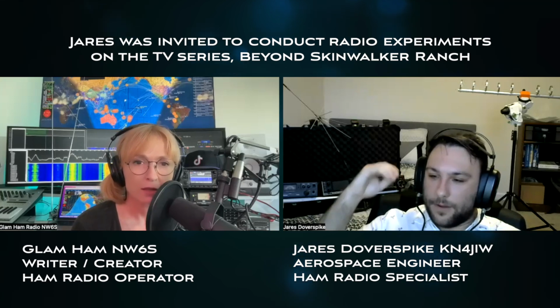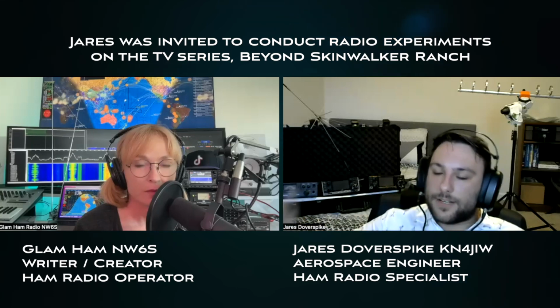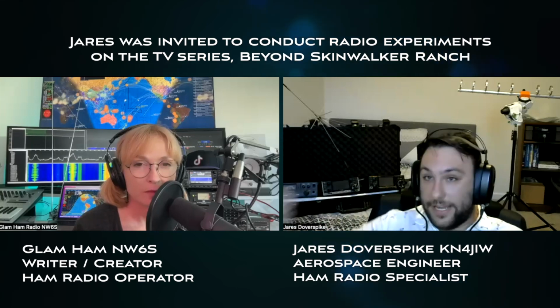Right. So I still have to follow, like I said on the show, all the FCC guidelines on the clarity of the information on the signals that I'm sending. So I can't intentionally distort the signal in order to add additional energy into the specific harmonics. But one of the things I was doing is wanting to transmit on 144 megahertz, the 11th harmonic, in addition to the 400-something megahertz harmonic, which would be the fourth harmonic of 1.6 gigahertz.